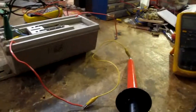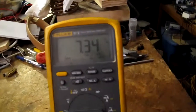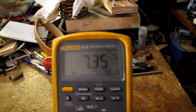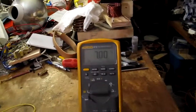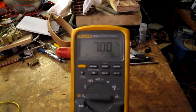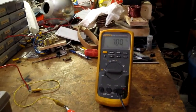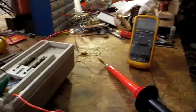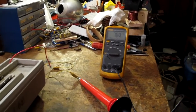No real hum from this one, but we've got 7.3 — so 7,300 volts on that side. And now on the other side, we've got 7, so pretty close to 7,000 volts. Adding the two together gives 14,300 volts — a little below spec but not by much, and it's not that important anyway. Now to build some voltage doublers.